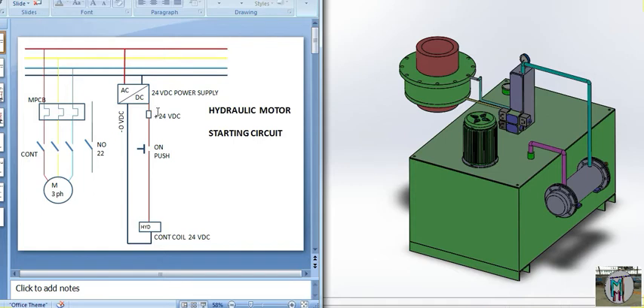After fixing a fuse, we fix one push button. When we push this button, supply will enter the coil and the coil will be on, which means supply will also be on to the motor and the motor will run. When we release the push button, the motor will stop automatically. So we cannot hold the push button for a long time — we need a circuit to start and hold the motor continuously.